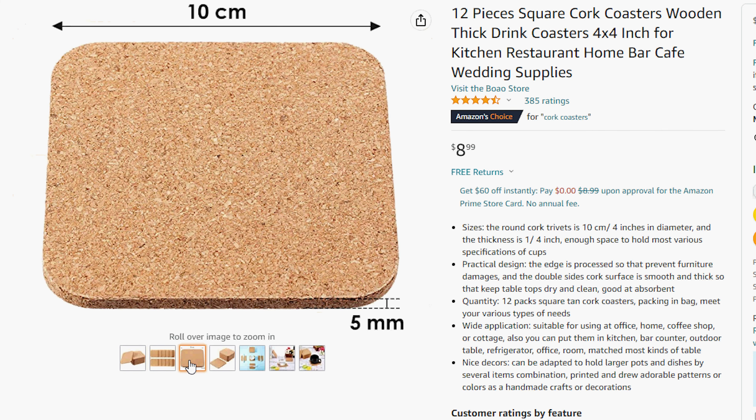After this is finished, I could load another set of coasters on the same chipboard outlines and run the same job again, or I could keep this piece of chipboard and load it back into the laser — making sure it's pushed to the top left corner — if I wanted to make more with different designs. I could also reuse the material for other temporary jigs by marking over it again and again until there are too many lines and it gets confusing. We call these temporary jigs because they're pretty disposable, though you could use them as a more permanent solution. The reason we don't is that lining up parts on each outline increases the chance of something being slightly off, parts are more likely to move due to air assist, and it's slower compared to using rigid, durable jig trays that can be pre-loaded and unloaded outside the laser.